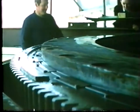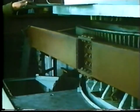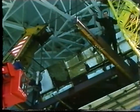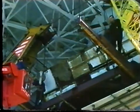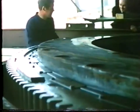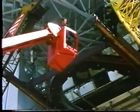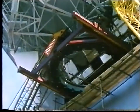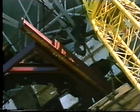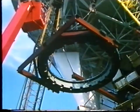A fortnight later the new bearing arrived from the factory by special transporter, angled to reduce the overhang of the load when on the public highway. After being unwrapped, the bearing was examined for possible damage. Of a stiffer construction than the old, the new bearing contains two sets of rollers at right angles, whereas the original was of the wire race type containing balls, not rollers. A calculated amount of flexibility was built in, provided by rectangular compression pads on top of the bearing. Dowel pins underneath had to be located accurately with the holes in the capping ring on the tower.